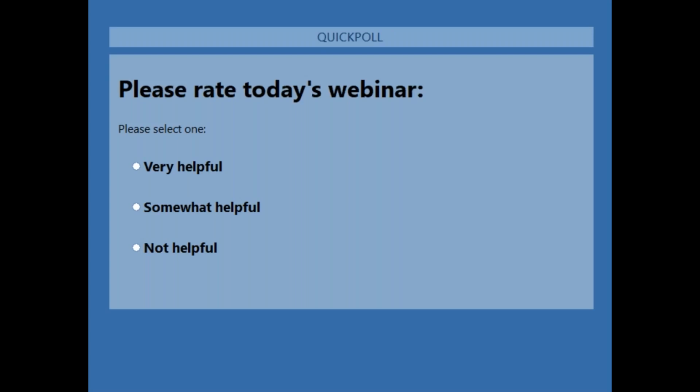Okay. Maybe you already explained this. Could you explain again why Tracker controls everything but not frequency? Oh, I don't know if I mentioned that. I didn't go into details, but yeah. Tracker controls pulse length, gain, absorption, spreading, all the basic sonar settings. It also controls the swath coverage if you want to, but it does not control frequency. And the reason for that is that the seabed responds differently to different frequencies. So if you run a 400 kilohertz survey and it gets deeper and deeper, you don't want an automated algorithm to suddenly change that frequency from 400 to 350 or to 300. You want to be in control of that. So Tracker will control everything except for frequency.